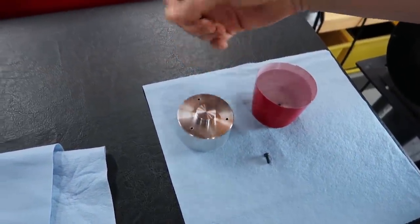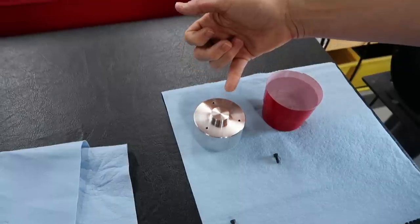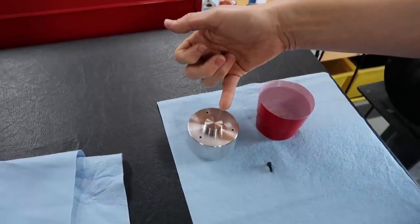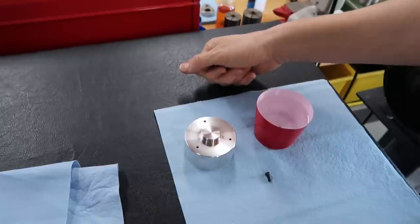So if I left them as is, when I did the surface cut, the lathe cutter would be hitting the screw heads. Oh, yeah, and we really don't want that. Especially when we're cutting for cosmetic purposes, I don't want that cutter hitting the hardened screw heads. Yes, step-offs and jumps.